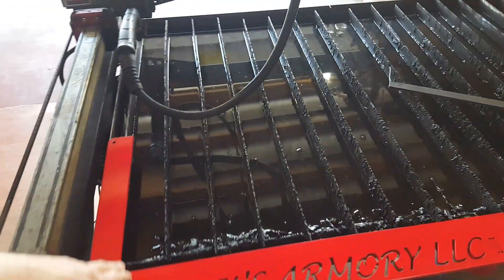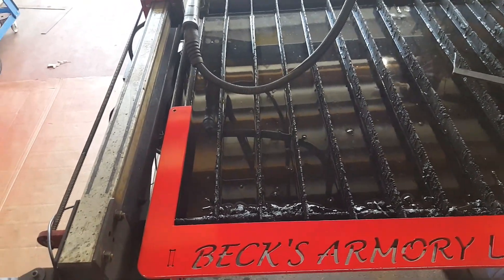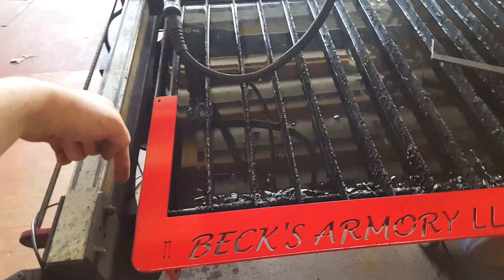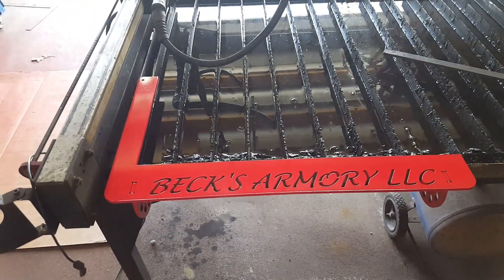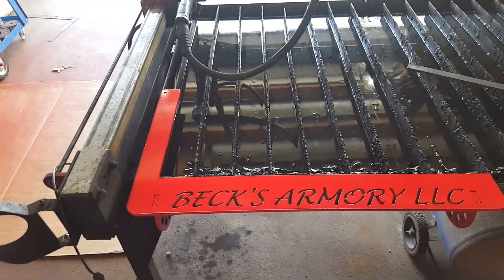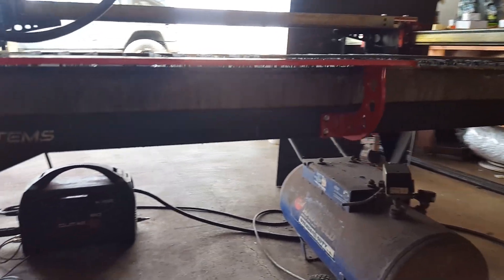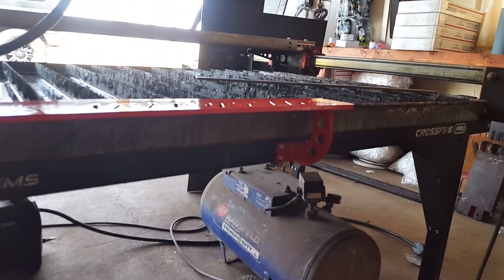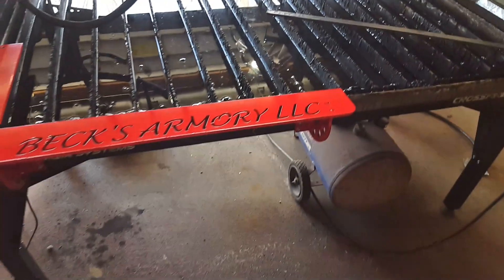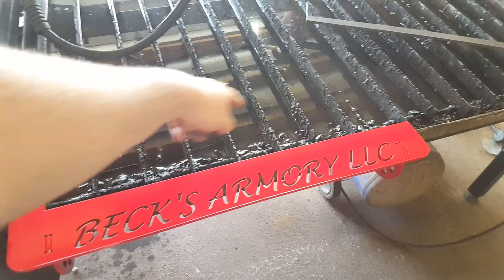After I mounted it, I came to zero-zero and did a Y cut up against the X stop. Then I came down and was up against the Y limit and did an X cut, so it is exactly where it needs to be. I didn't even use the jack bolt in the corner because it's so rigid — I made it at a quarter inch, so it's rock solid. Just used the self-tappers that are used everywhere else on the table. Overall, pretty excited. I was able to lay parts right on there and cut my logo into the parts.